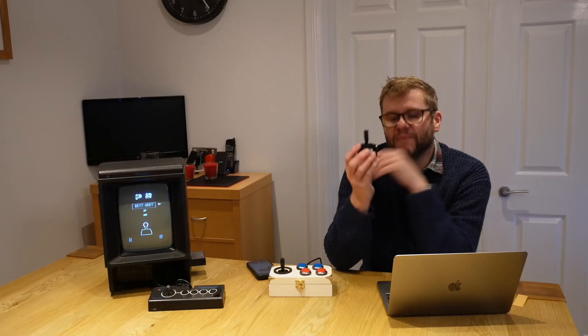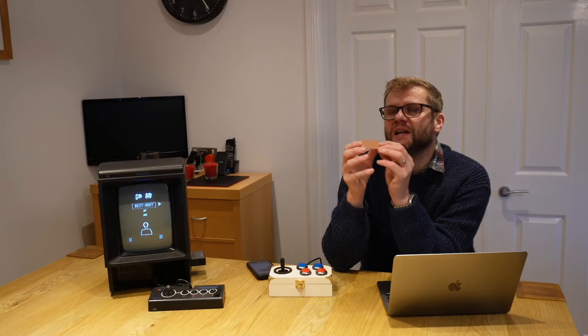As I mentioned in a previous video, I ordered some modern analog joystick modules — 10k resistors, absolutely perfect for what we need. I then bought some project prototype boards, which have a grid of holes with strips of copper going horizontally joining them up. I designed a layout for that board based on the circuit diagram from the service manual.